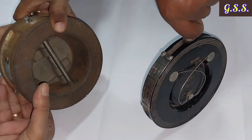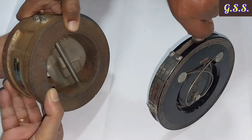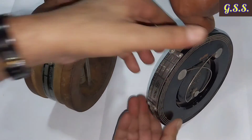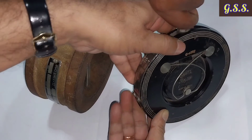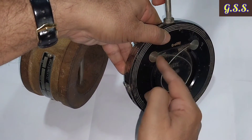In the case of the dual plate check valve, there is less possibility of debris accumulation, meaning less possibility of disturbance. In the case of the single flap check valve, there is more possibility of debris accumulation in the pin zone and the annular zone.